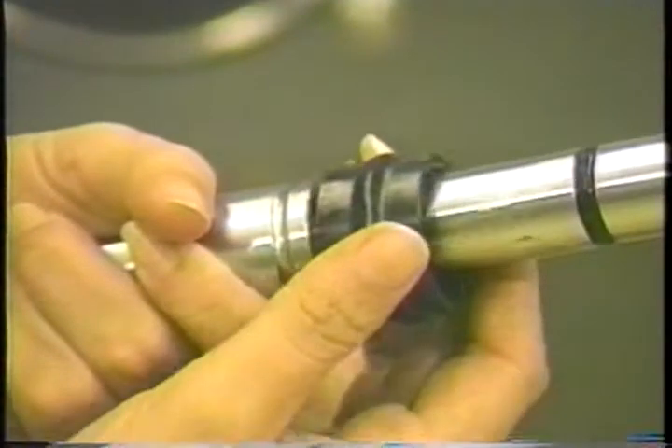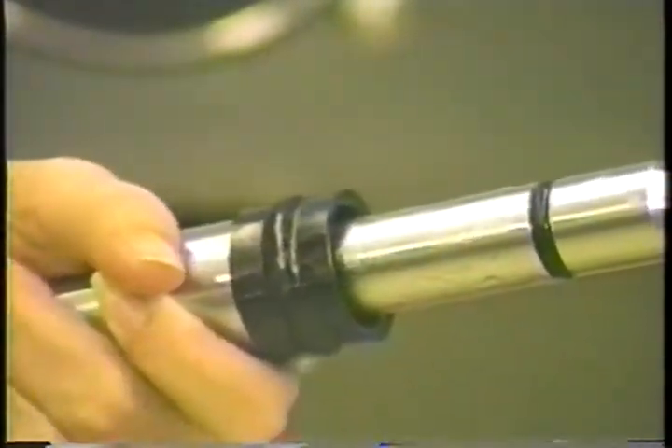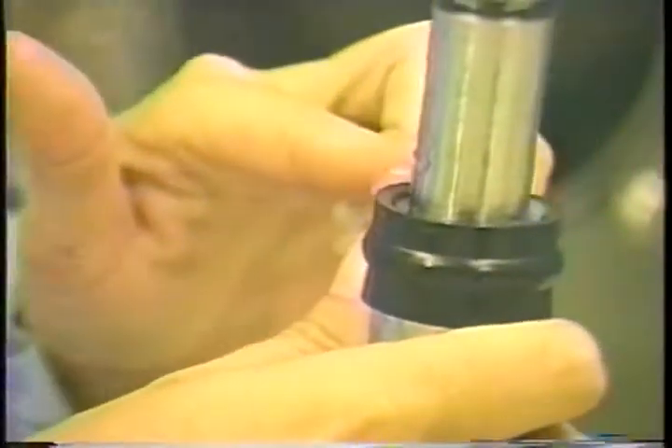the square end of the shaft. Slide the boot seal on until it snaps into place on the groove. Fill the seal with lubricant and evenly coat the seal edge. Firmly insert the drive shaft into the rear shell bearing